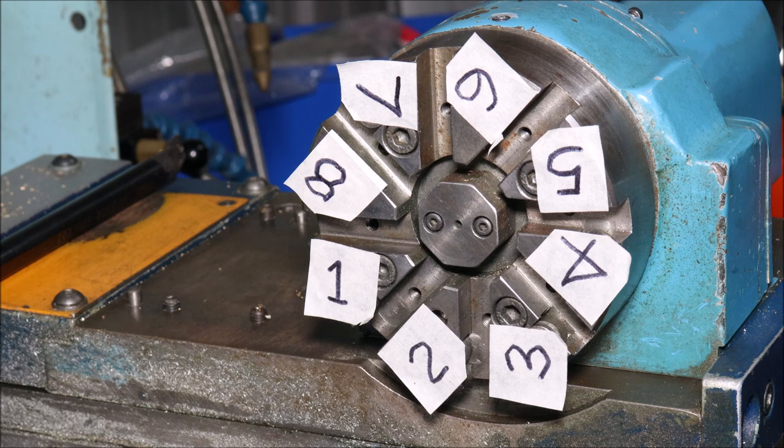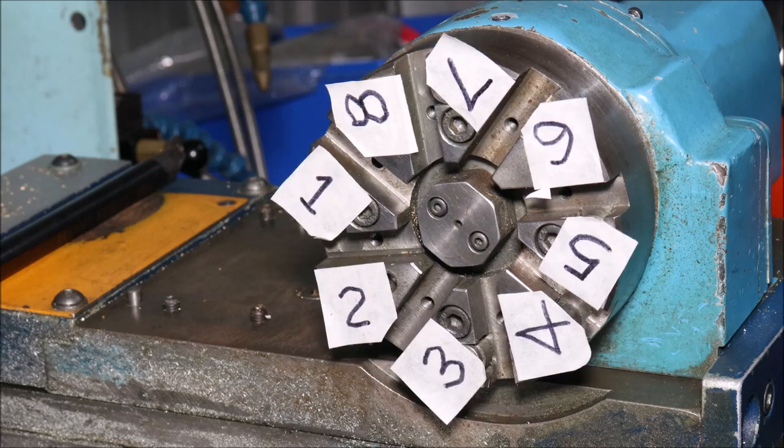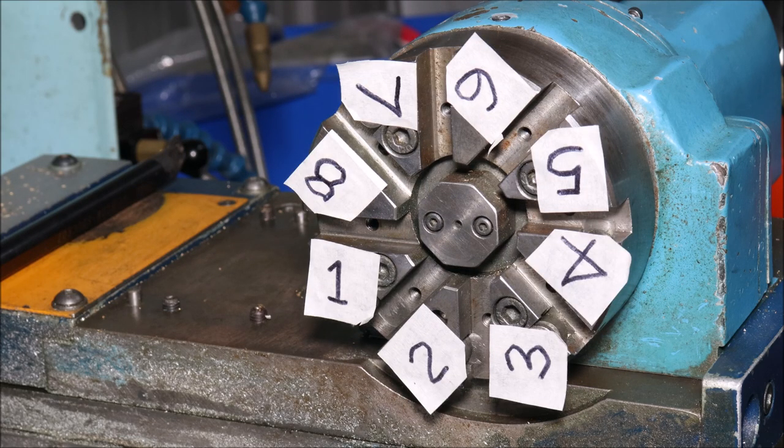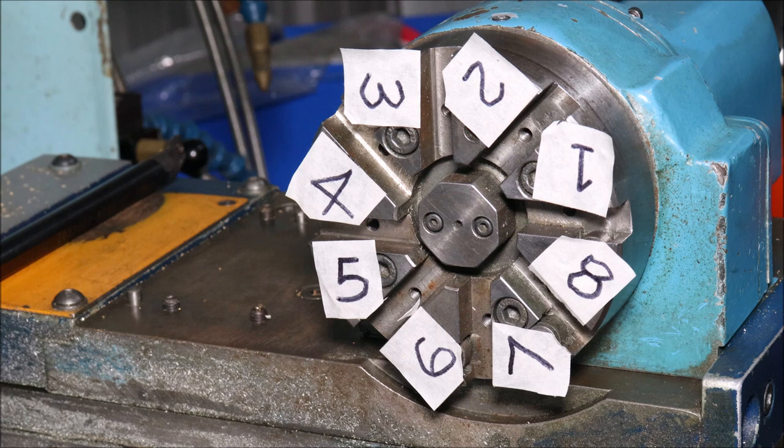This is homing the tool in manual mode and we're going to click on tool one. Okay, that found it fine. Now I'll click on previous tool, and there the turret stopped. I've just got to wait for the tool turret non-functioning label to come up.